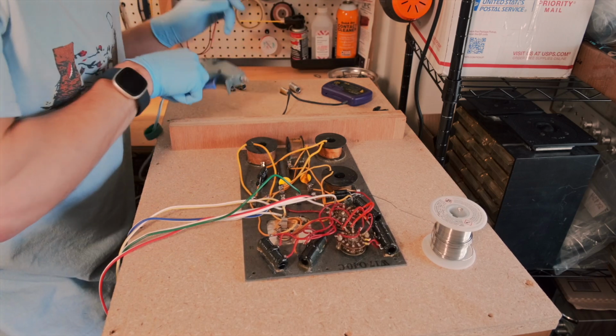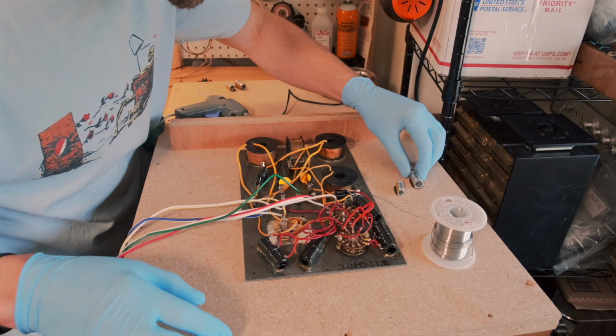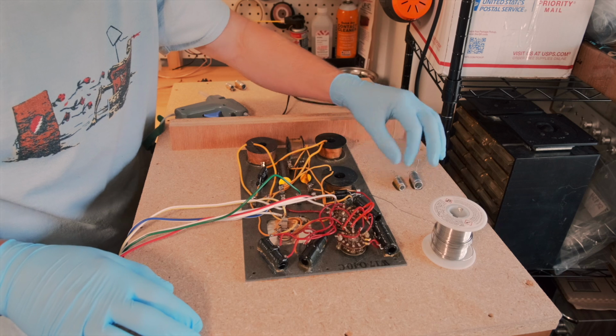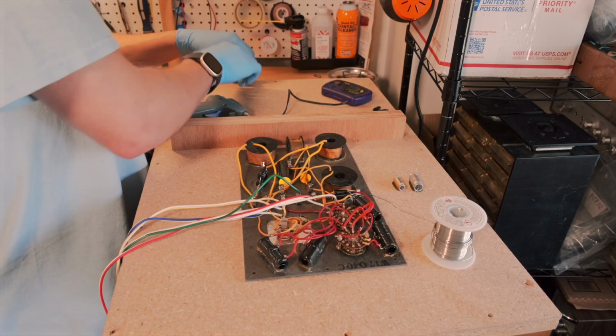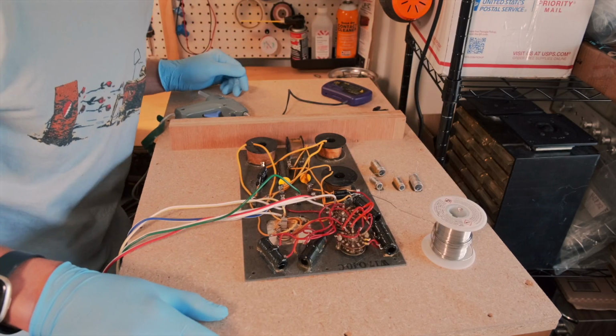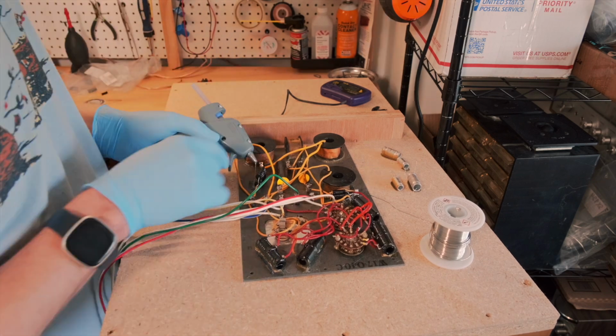The only thing left to do is add some hot glue, and I tested, and the 3.3 and the 14 are within spec. They're below the 20% tolerance they should be at, but this one is about 18% out, so it's very close to that. While the 0.5 microfarad and the 7 are right at 20 or 21% tolerance, which is not great.